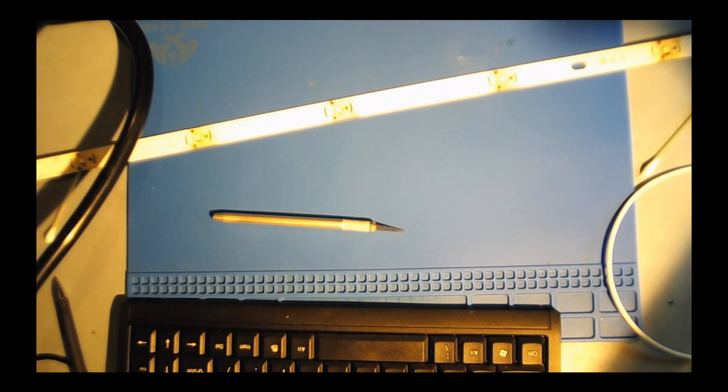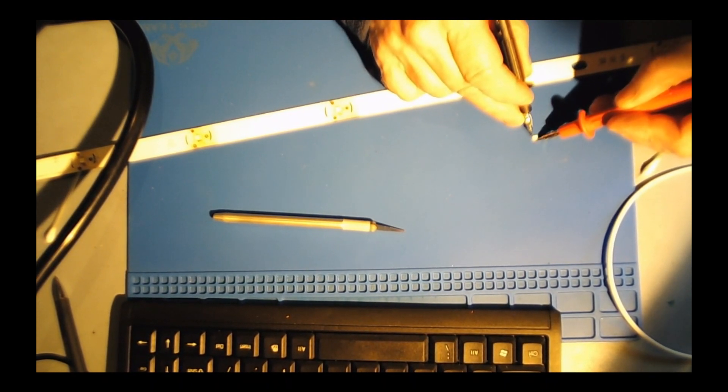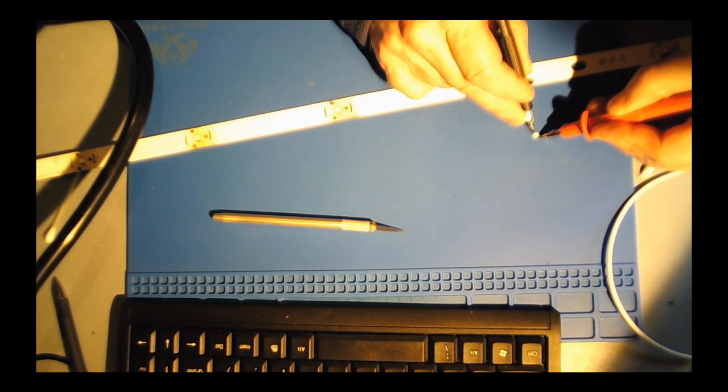The way I test each one of these diodes: I get a power supply and ramp it up to 6 volts. I'm on 3 volts now — the diodes I took out were 3 volt diodes. I'm going to put the power supply at 3 volts. If you put 1.5 volts across these they don't light up. So we can confirm that these are 3 volt diodes.